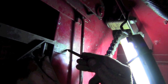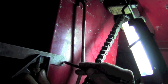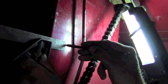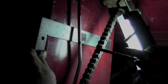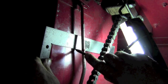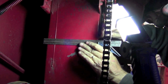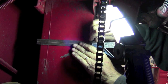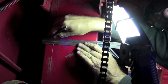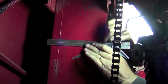This step shows the care taken when measuring for the yield sensor hole location. This location is given to you in the supplementary installation instructions and in the appendix provided. For this particular model, the location is just below the grain tank floor and 60mm from the back edge of the elevator. If a location is not given, mount the sensor as high as possible and measure the distance to the center of the elevator paddles. This will be your mounting location.